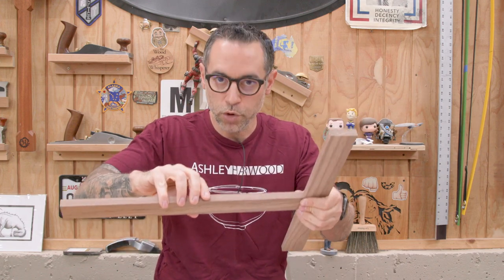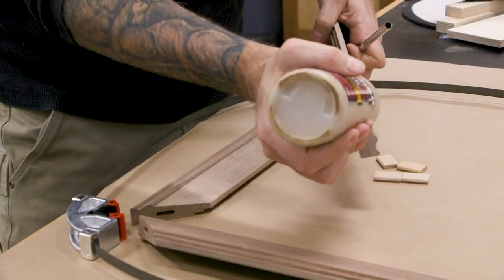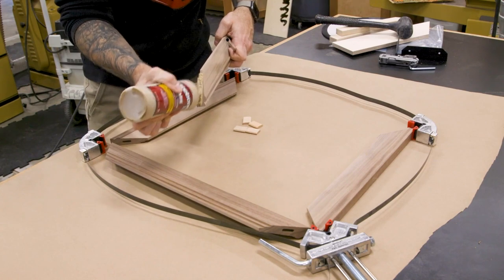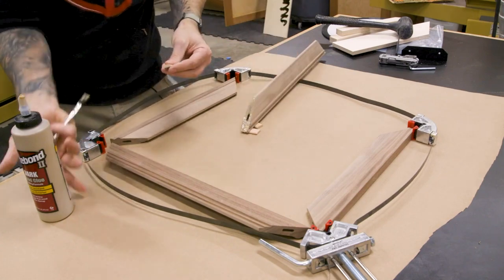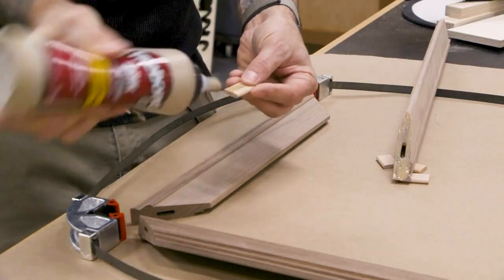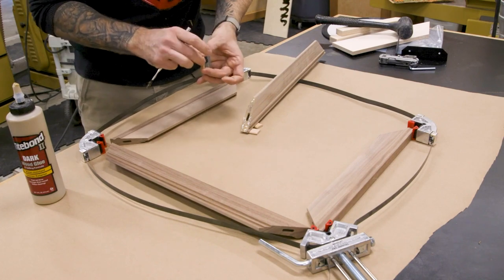So I implore you: please do not throw away your dominoes, your pocket jigs, your bead locks. If you make traditional joinery, don't just stop doing it — this stuff still has value and adds considerable strength to the joints we make. I honestly think Patrick would agree. Also consider wood movement: over time, a joint experiences expansion and contraction that stresses the glue and can weaken the bond. If you make a picture frame with just glue on miters, that movement can weaken those connections — which is why we use splines to reinforce them, adding long grain strength across a somewhat weak joint.